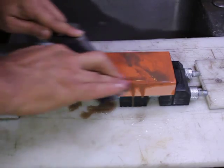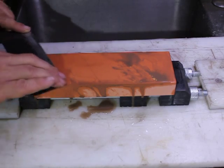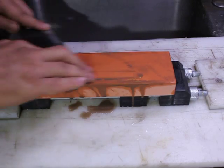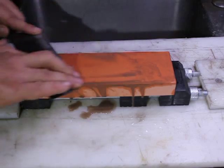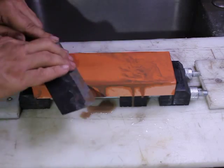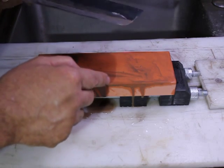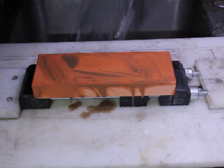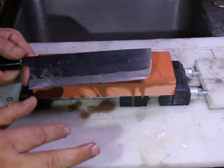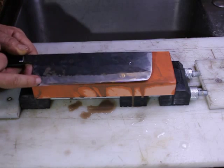And I'm pressing fairly firmly, at least initially here. Again, porosity, not a very porous stone, so it holds its water very much like a polishing stone, like a natural polishing stone. Okay, let's see. Oh, quite nice. It is developing some contrast. Okay, let's take a look at that. Okay, so we are seeing a nice bit of contrast between the soft and the hard steel, flattening out.